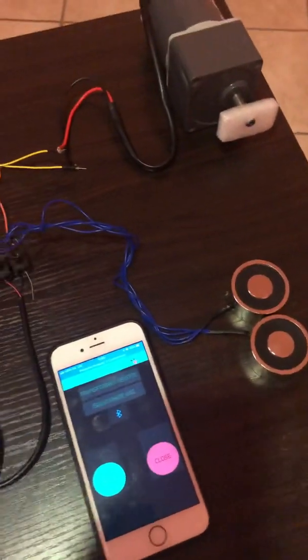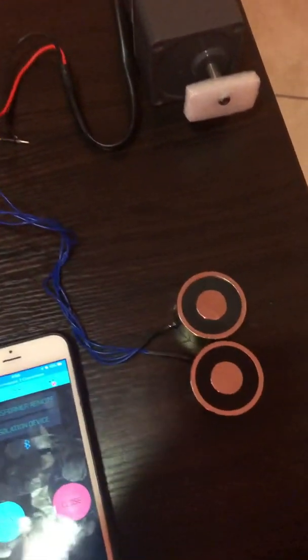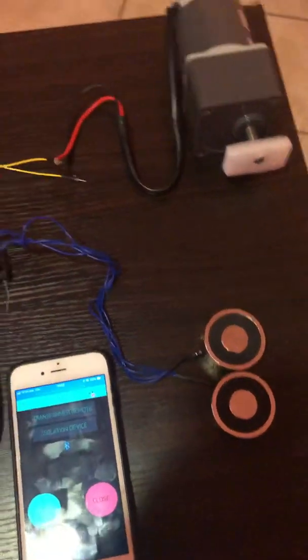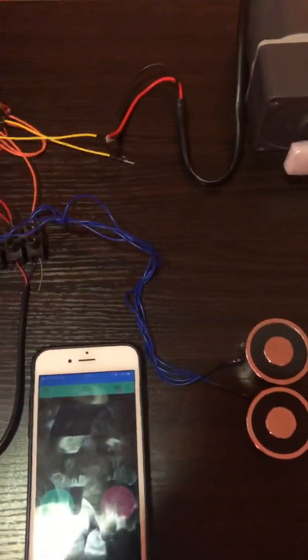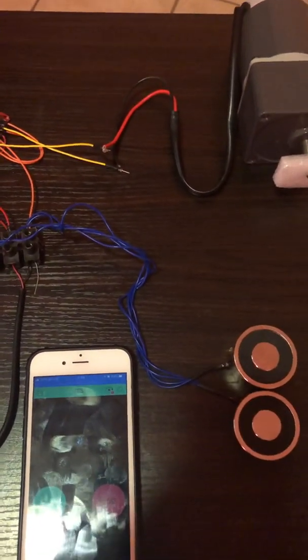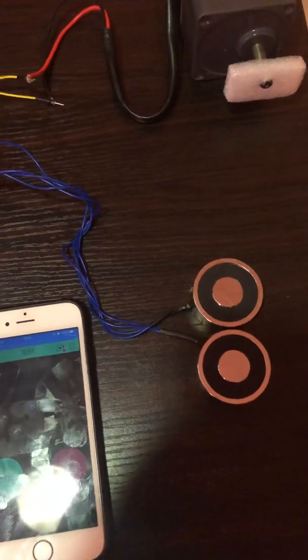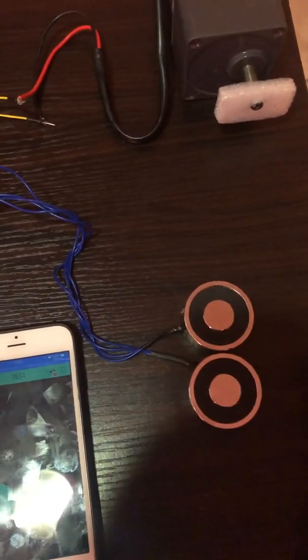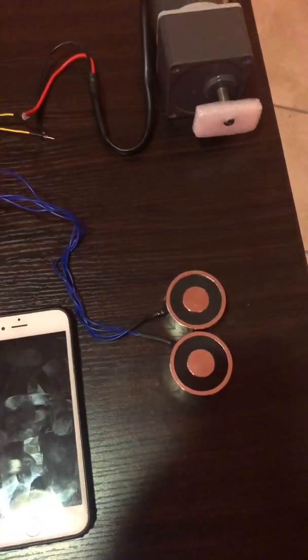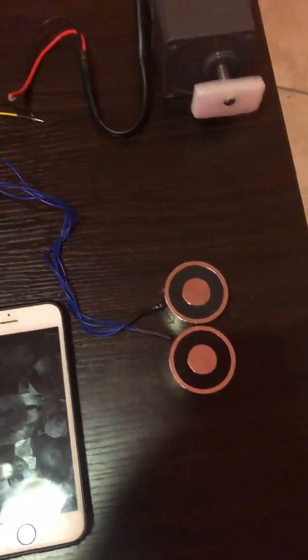And the magnets: the compartment of the pad mounted transformer is made out of steel. So we needed something that can help the system stick onto the load break switch, because there are no supports there. So I'll be using these electromagnets as the support for the system to hold it in place while it does the operation on the load break switch.